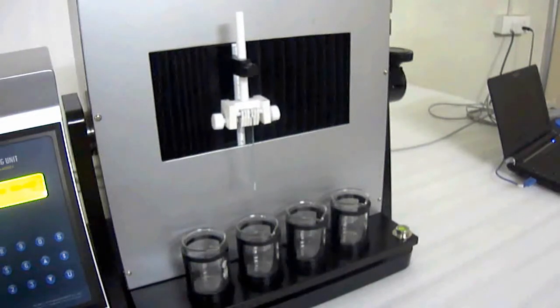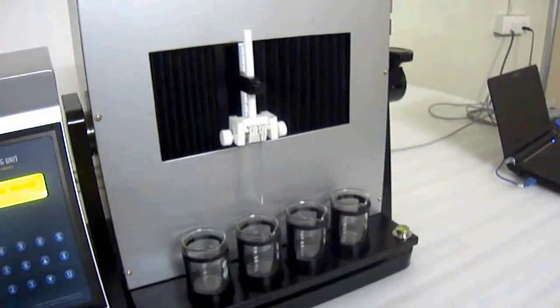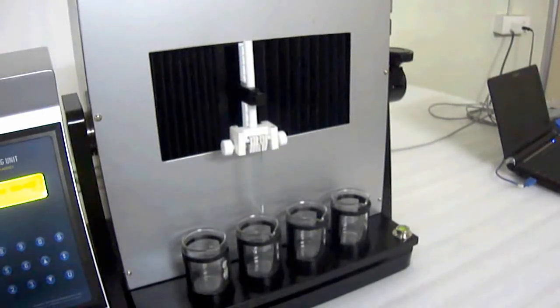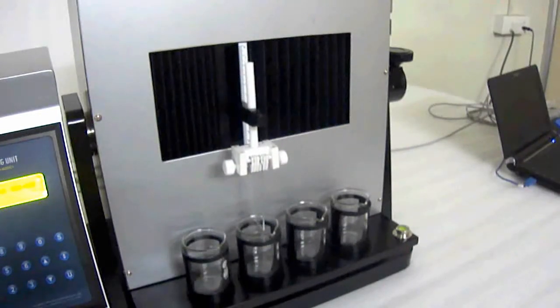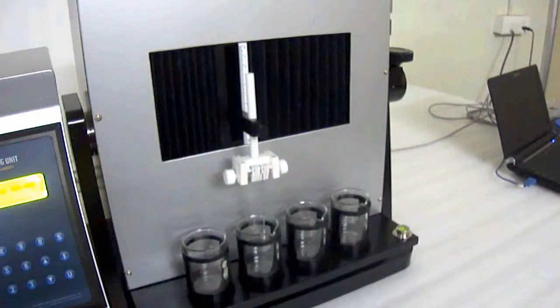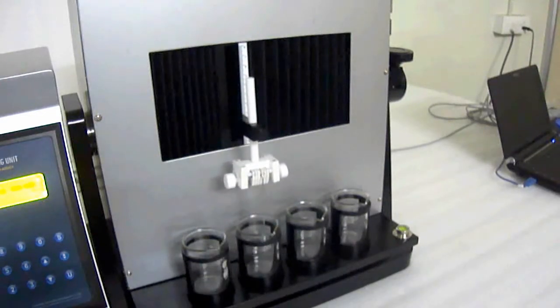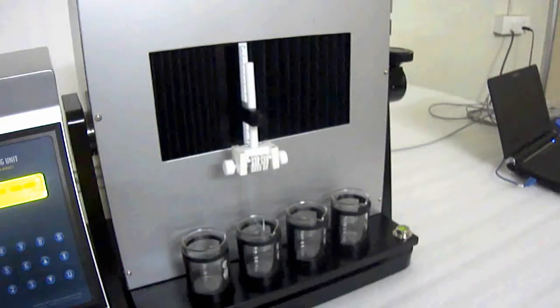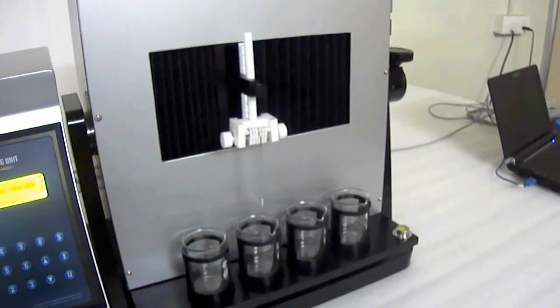Once the substrate is dipped and coated in the solution, it is withdrawn and the coating is allowed to dry as per requirement. A microprocessor-based system, along with user-friendly software, takes care of accurate control throughout the process. The system is compact and complete with mechanics, substrate holder, electronics and software.